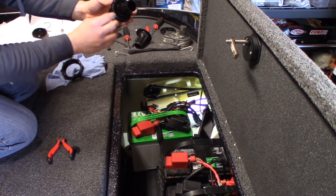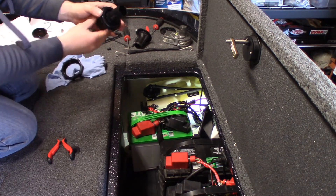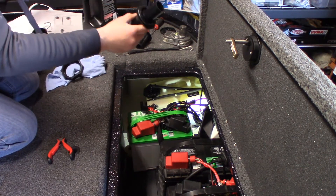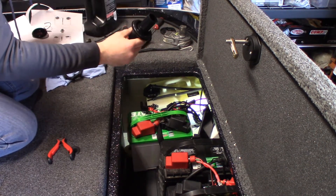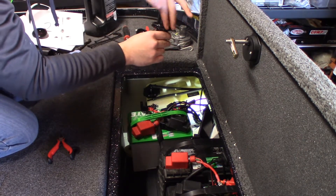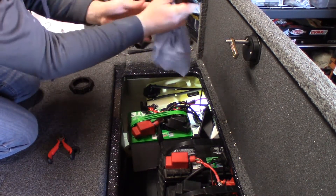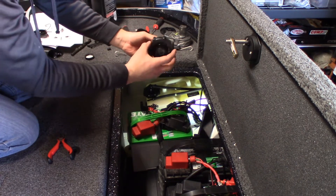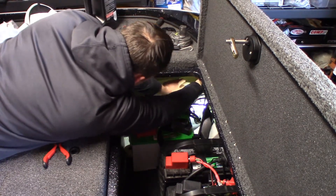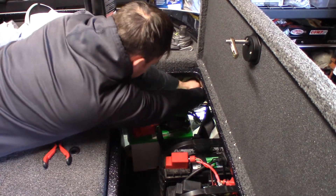When actually putting this into the tank there's a seal you have to put on here so no oil leaks out. To make this really easy, take some two-stroke oil and put it around the actual rubber o-ring — otherwise you're going to be fighting it. Take your finger and dab a little bit on the edges. Make sure you don't get it in your carpet, especially if you have a brand new boat. It's going to fit in there just like that. Make sure you feel the seal actually sit in there and push down.